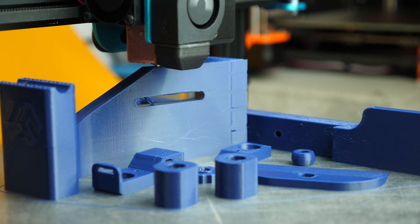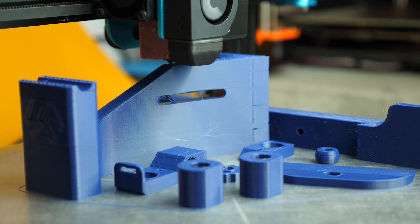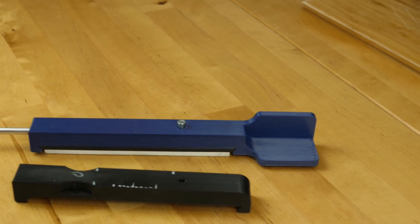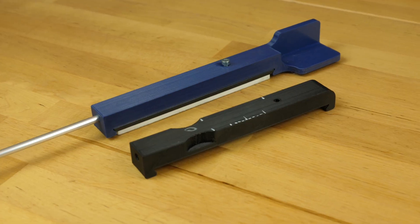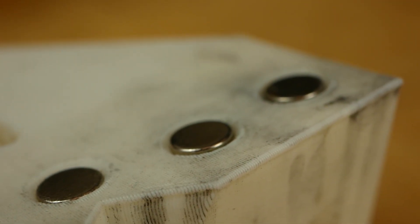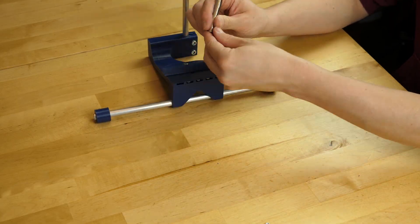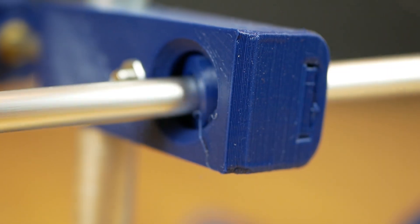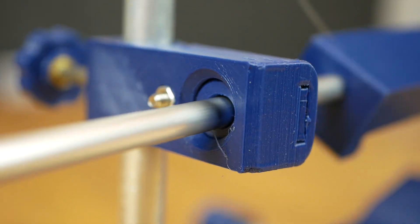If you want to make one yourself there are links to the CAD files and the STLs in the description. Since I created the initial design in another CAD software this was also a good lesson for me in how assemblies are handled in Fusion 360. Most notably the new design features a longer handpiece with a finger guard, which makes it easier to hold and protects you from cutting yourself. The blade is held in position by magnets — the old design had the problem that if they weren't perfectly seated they could scratch the metal. I now added pockets from the side into which you can slide 10mm diameter disc magnets. The most important improvement, taken from a remix, is the guide which ensures the whetstone stays at a perfect angle. The old one only used a hole which allowed for some play, whereas the new one uses a spherical bearing which has way less play.